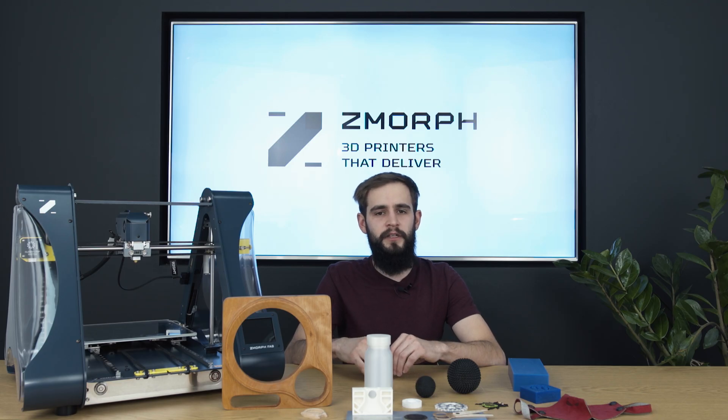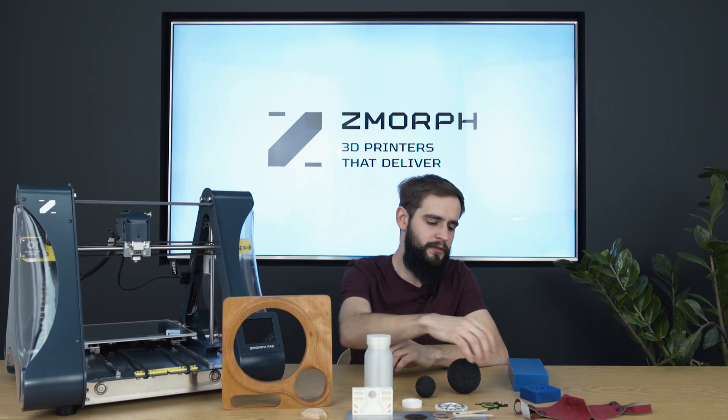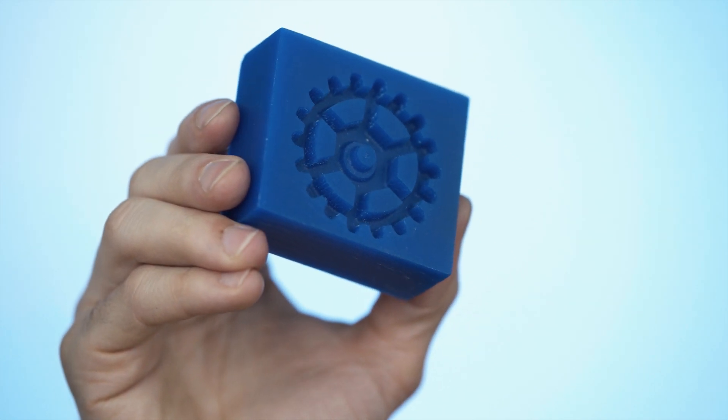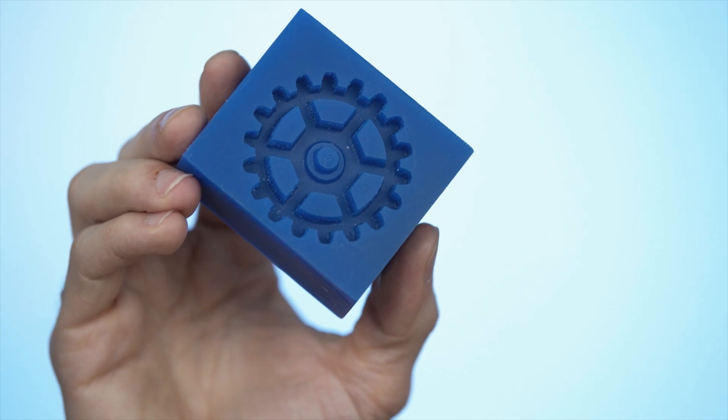The next material is machining wax. This material has perfect machining properties, resulting in high quality finish and high dimensional accuracy, which makes it a perfect fit for making molds for casting — so making jewelry or small prototypes can be even easier. Another use is running proof-of-concept CNC programs before trying on more expensive materials. One great benefit is that machining wax is reusable and recyclable.